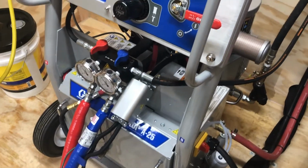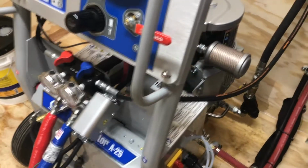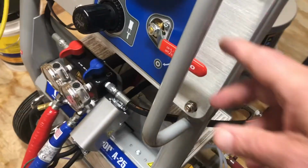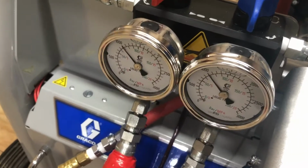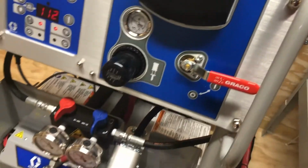So there are also a couple other untraditional ways to park this thing. If I wanted to, and I already had the gun off the block, same thing here. I'm going to put the machine in the on position. I'm going to move this forward, and I can either bleed these blocks off, because I have to get rid of pressure, bleed the blocks off until I know the machine parks. That's one way to do it.